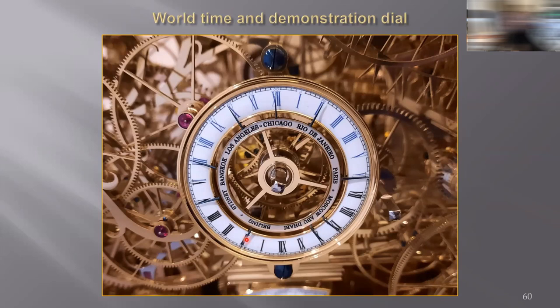It's one of those compromises that has to be made once in a while. Here again, you get to see the beautiful blue and contrasting red that is sprinkled throughout the background of the brass movement. One thing I did forget to add is that all of the wheels in the main trains, the bigger wheels, are all made of pink bronze, whereas all of the smaller wheel work, all the behind the dial wheel work, is done in regular brass. So you'll also have that pretty contrast when you look at the machine.